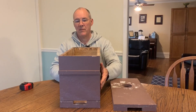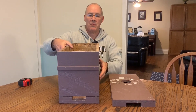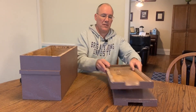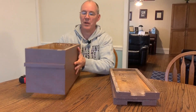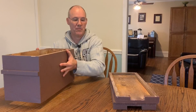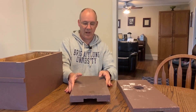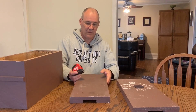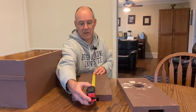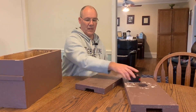Let me give you some measurements on these boxes. The most important thing to remember about any type of bee box is the width is what matters; the length is going to be the same on any of them. On any type of nuc box or deep hive body, the width is what matters. The exterior dimensions really don't matter at all — it's just the width and the length to make sure you have room for the frames. To make the bottom section, it's real simple: just cut a board out of basically three-quarter inch plywood, 9 inches wide by 20 inches long.